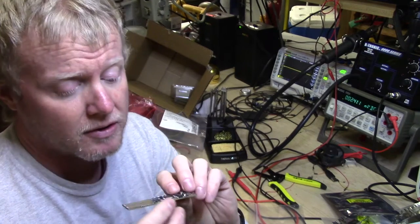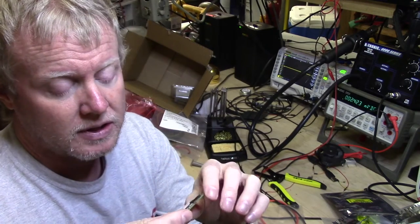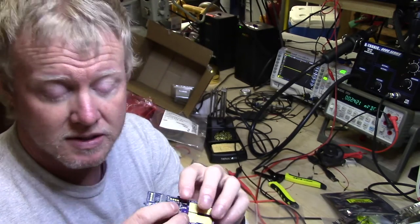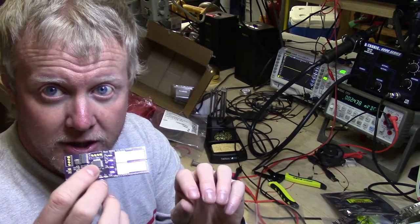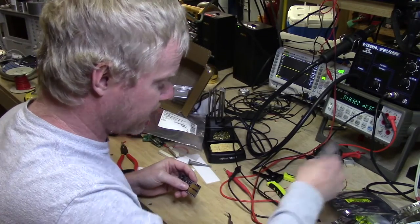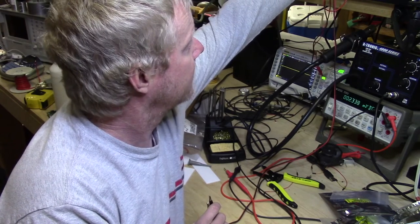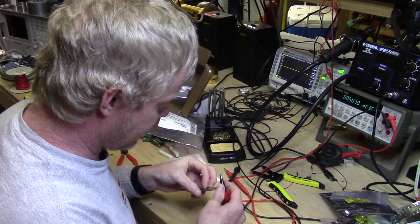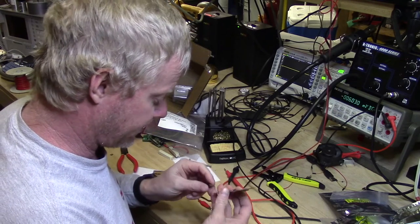And that'll tell us what we want to know, whether this opto-isolation circuit that we've built will actually do what we want and get our 12-volt inputs to the STM8 without burning it up, hopefully. Okay, I'm just going to hook one of these up. And again, you want to use something that's got current limiting. I'm just going to allow a little bit of current, and hopefully we don't see any snap, crackle, pop, or let the magic smoke out.